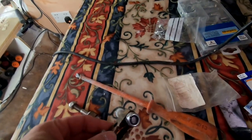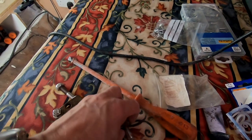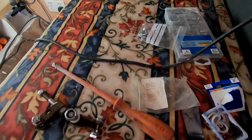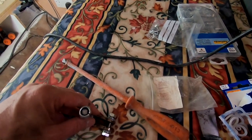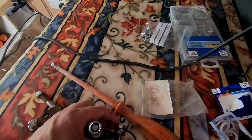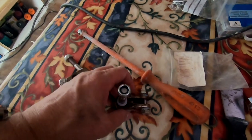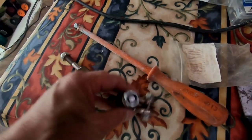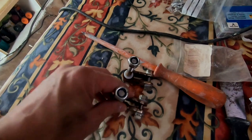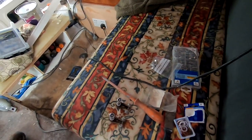The rudder, I haven't cleaned them up yet. I've just found a nylon washer. So I've got A4 stainless bolts. So that'll bolt to the rudder arm, like so. And then the steering rod will come into here, and that'll be clamped up firmly, but not too tight, so everything can twist and manoeuvre. It's all A4 stainless with nylon washers to aid it in its turning. And when it's nice, I'll get outside, give all this a good clean up, put it together, and then smear it in marine grease to keep it running nice and smoothly. Not too bad.